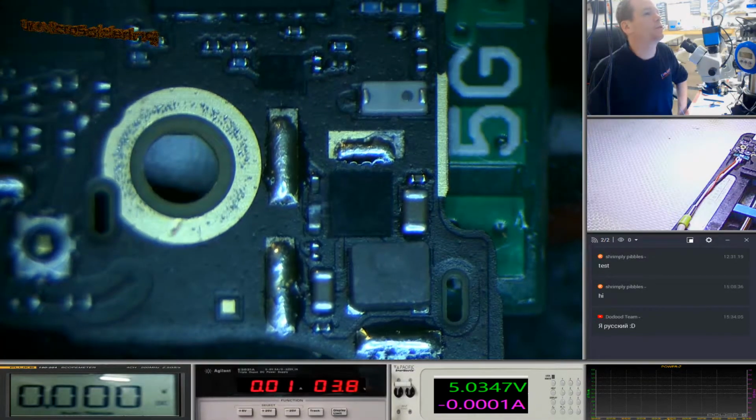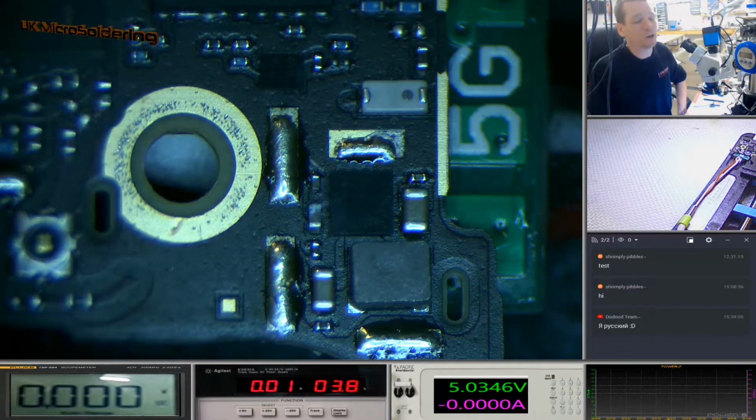So yeah, what's happened, it's caused a short underneath this IC, and it's made this part of the board so hot in 4 minutes that it's just evaporated all the liquid. I mean, you've got a mild little bit around these weld points, but I don't know if it's still got the short, because it's not pulling power, it's still pulling the 0.1. So it's not VC bat that is short.